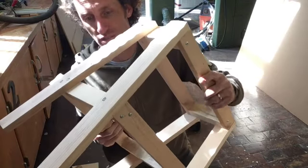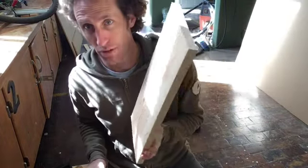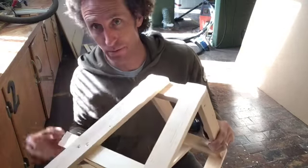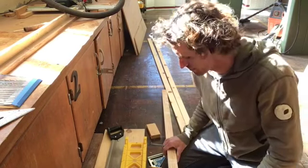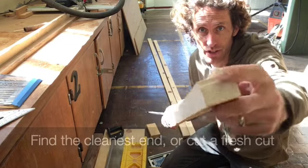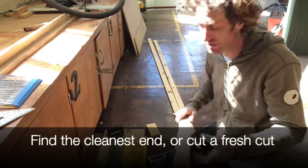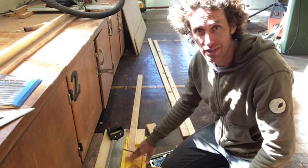We're going to start by cutting all the pieces. Your pieces for the top are already cut to length because they don't fit in your miter box — Mr. Coop did that for you. Before we get going on cutting, start by finding the fresh cut end. If neither end is smooth, set up your saw and cut a very small amount off so you have a clean cut.